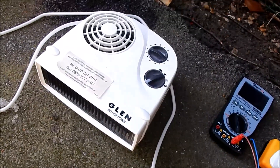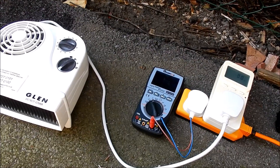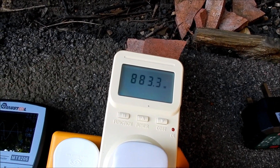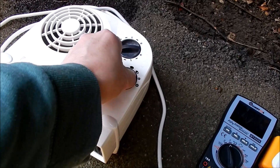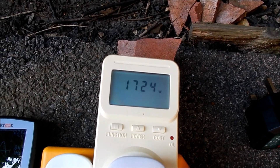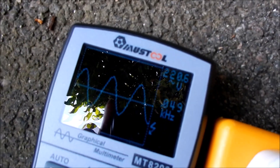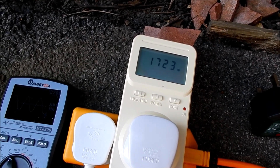Now I'm going to start using this fan heater to draw power and see how much I can draw. I'll turn the heater on. I've now got the power meter in the watts setting — that's saying 884 watts. It's a bit lower than one kilowatt because this is a one kilowatt heater rated at 240 volts. Let's turn it up to the two kilowatt setting. I'm now pulling 1.72 kilowatts and I can feel a fair bit of heat coming out of the front of that heater — all going up into the sky, wasted. The sine wave hasn't changed. I can only pull 1.7 kilowatts with this two kilowatt heater.